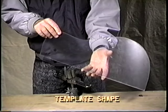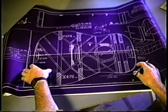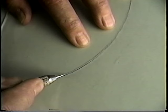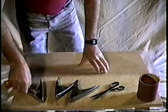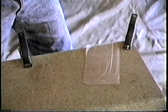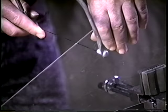We started by making a plastic template showing half of the guitar's outline, used in several stages of construction and helpful in choosing the woods. You can make the template by tracing an existing plan, copying a guitar body with a pleasing contour, or creating your own design. The outline was scratched into a piece of transparent plastic about an eighth inch thick, then sawed out just outside the line. A simple solution to prevent the plastic from splitting is to tape it onto a piece of composite board. We filed down to the scratch line and cut a notch to mark the center.